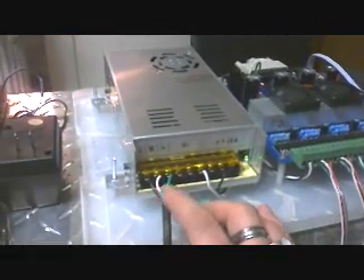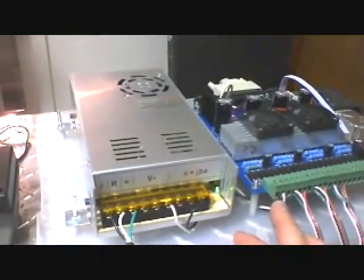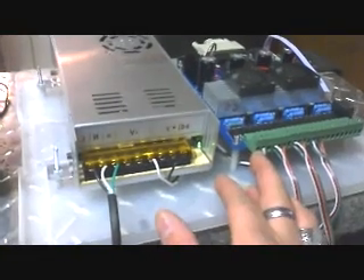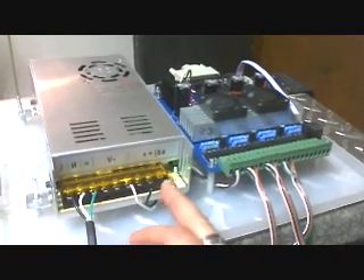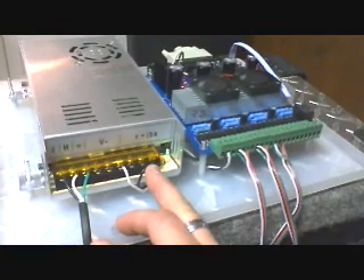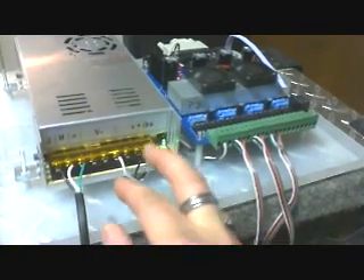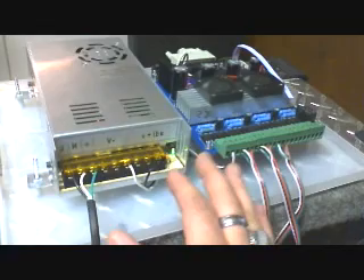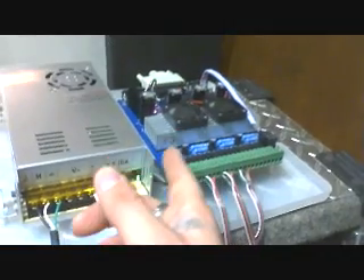Under ports and pins — I believe it was — it's supposed to be this but I left it here on this port, that's your main parallel port. Under motor outputs: enable these — 16, 14, 3, 9, 1, 7, 6, 8. Then inputs — all ones. Outputs: enable these — there's 4, 17, 5, and 5. Hit apply, hit OK.